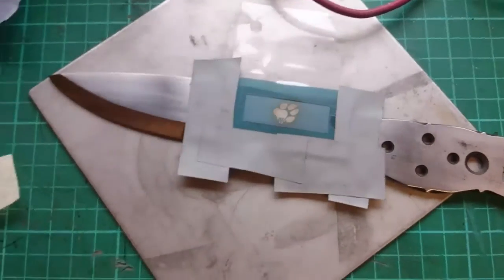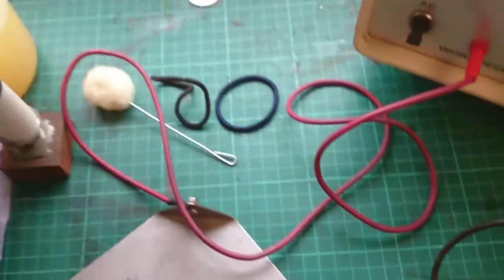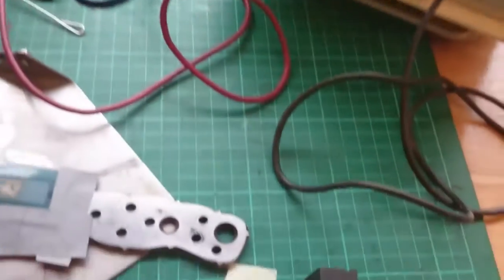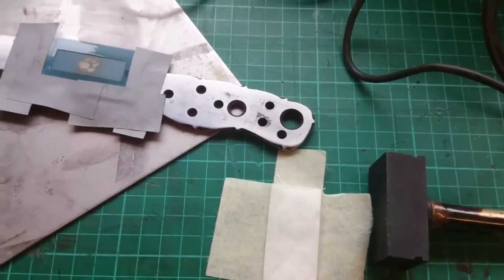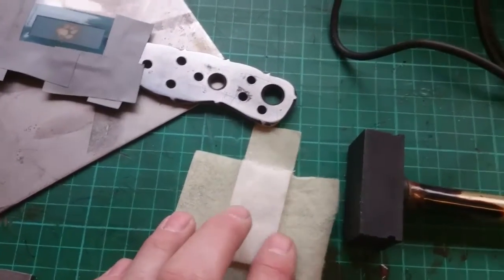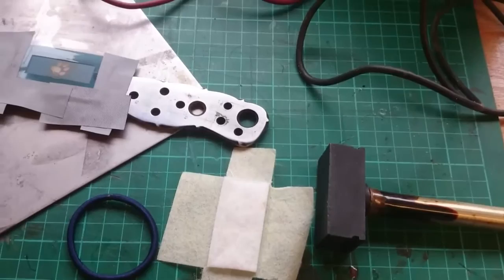What I'm going to do now is attach this pad over the graphite block, which will absorb the electrolyte. This is the electrolyte that I use — I'll put a link in the description. You could just as easily use salt water, but the difference is that with salt water you'd get a clean etch with no deposits — just the colour of the steel. By using this electrolyte and switching from direct current to alternating current, I should get a deposit put back into the etch to make it black. I've nicked one of my wife's hair bands to attach the pad, so I'll set that up and bring you back for the actual etching process.